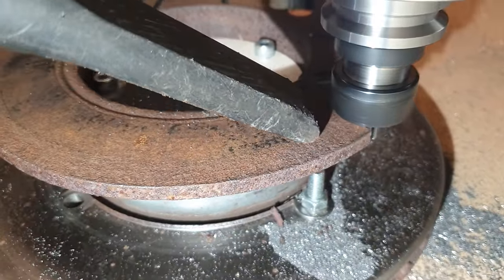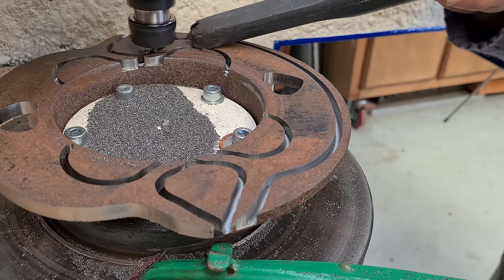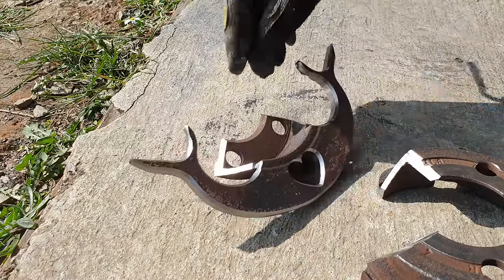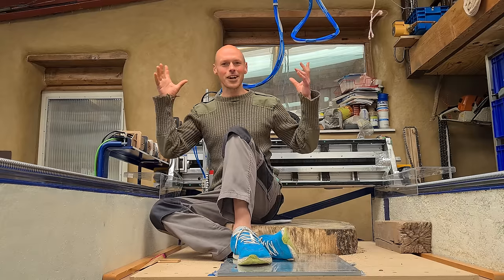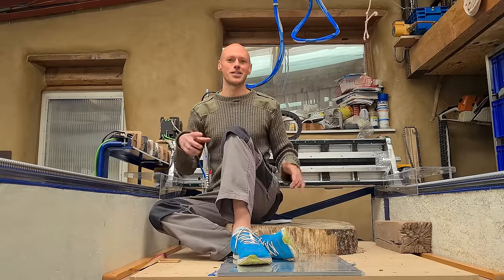The servos at the moment are all on their factory stock tuning, and I'm noticing that the curvy diagonals are quite a lot more ripply than anything in either the X or Y direction alone — leading me to suspect I might need to look at the tuning. There's been so much to learn building this machine and the potential of this new tool is kind of mind-blowing to me. I had to leave out so much in this video so if you've got any questions leave them down below. Check out the description for links to epoxy recipes and things like that — we'll probably end up writing a whole book about CNC related stuff. The next video on the CNC will be testing the spindle motor, so I'll see you then. Bye!